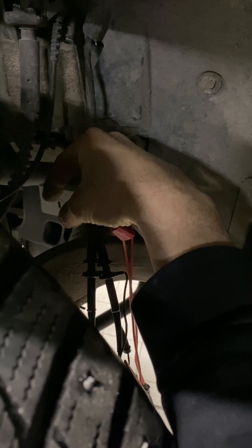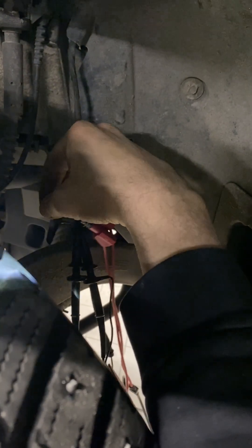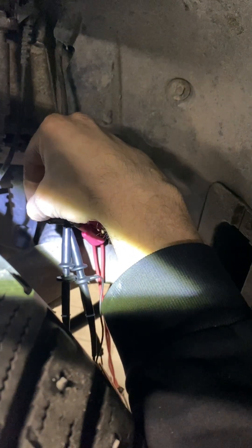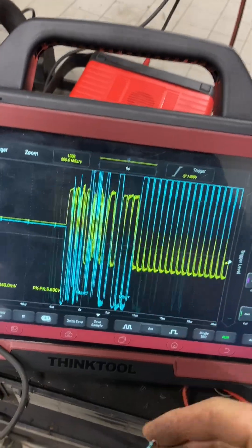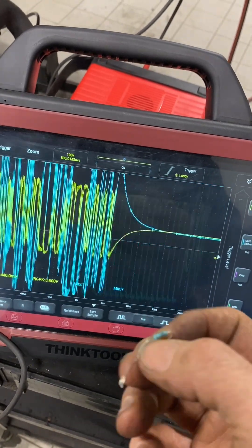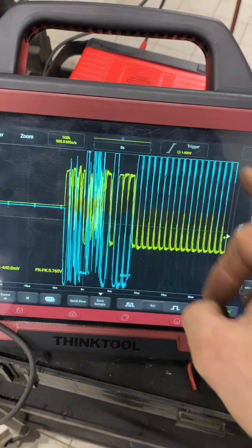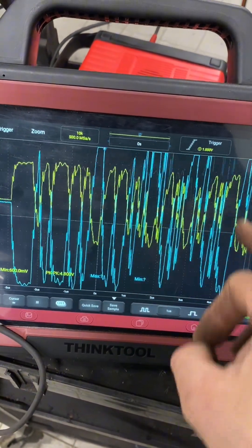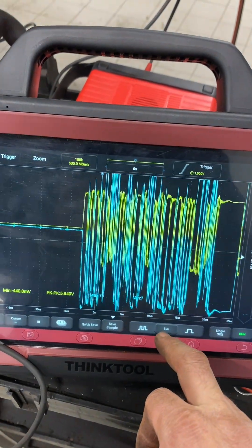This is the resistor I added because there are no dampers anymore. Let's take that out and see what happens. As you can see, the signal is now completely distorted. This resistor is needed to prevent signal reflections — the signal is there but you've got this massive reflection peak. That signal is now completely unreadable.